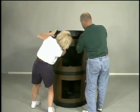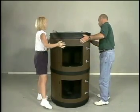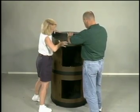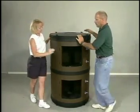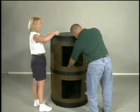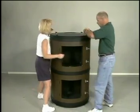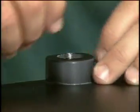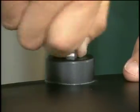Make sure you align the rods with the rod alignment holes in the end cap — the second panel edge should fit snugly into the end cap alignment groove. Lightly tap the end cap into position if needed. Next, take the four acorn nuts and quarter-inch flat washers and place them onto the rods rising out of the rod guide holes, then tighten as needed. Make sure the flat washer fits down into the rod guide hole — you may have to tap it into place. Tighten the acorn nuts using a seven-sixteenth inch socket wrench.